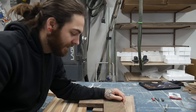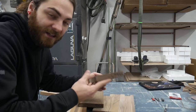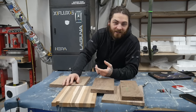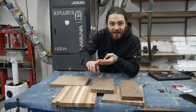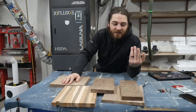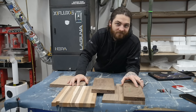I don't mess with a ton of thick stock, just because I don't generally have two-inch-plus thick stock on hand — it generally comes about 0.9 inches thick from my lumber mill. I also generally avoid very dense exotic woods like bloodwood, purple heart, and wenge. All that stuff's great, but it's super expensive, super dense, and very rough on your machine and your bits. It does work and it's beautiful wood, it's just not something I really mess with.